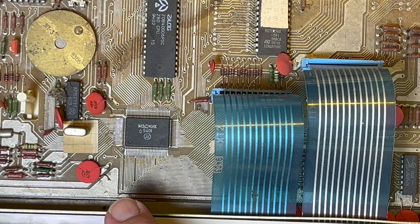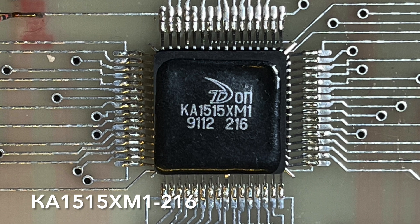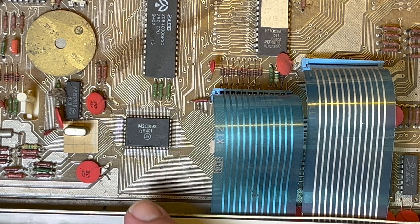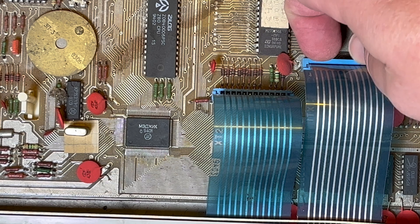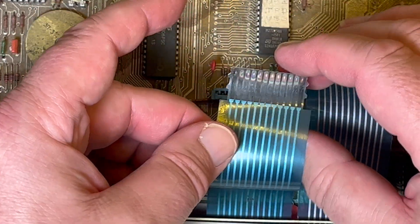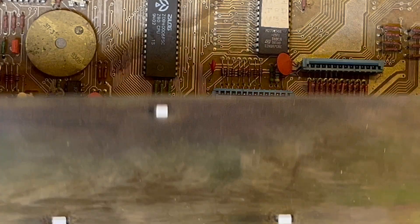I think this is a 100-pin BMK, whereas the usual one that we see - the more square one - is 64 pins. So this is actually more complex. I believe it's also got SECAM encoder included in it, that's from what I've read. As I've said, we've already figured out that it's a membrane keyboard - I think that's maybe the first I've seen on the Spectrum clones that I've been working on. I wonder if the Magic Electronics Corporation will sell me a spare.